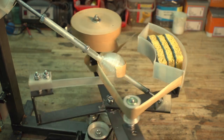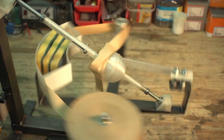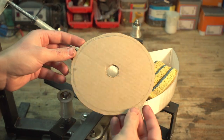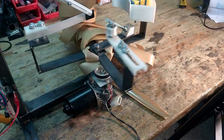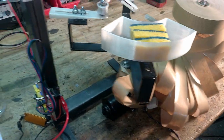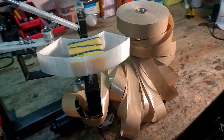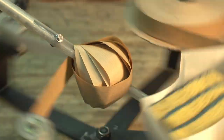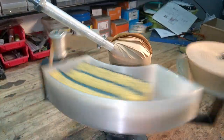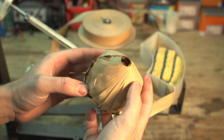As I was mounting the roll of tape, I already knew it was going to be a disaster. And it turns out my intuition was correct — it was definitely not working the way I had hoped. The first modification was to simply add a piece of cardboard underneath the roll of tape, to prevent the strands from unwinding and getting tangled inside the machine. I also bent the flattening bar in the right direction. This was a major improvement and the machine was actually capable of running. However, the results were less than impressive — the shell looked more like a rotten onion than anything else.